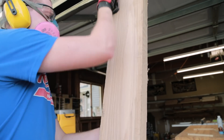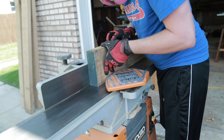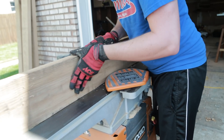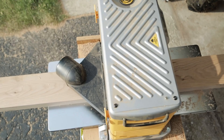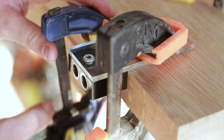With the solid oak top, I started the whole process by letting the boards sit in my shop and acclimate before milling them down to size. These 8-quarter boards of white oak will be milled down to their final size of 6-quarter before gluing them up into the table top. Before I glue them up, I am drilling holes for the dowels. This will help with alignment.